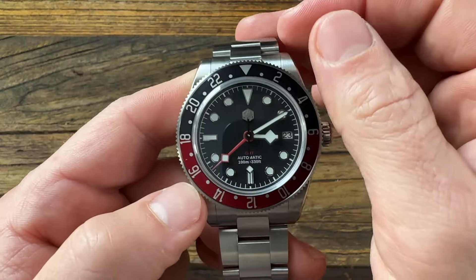Another test of quality is alignment. Is the dial perfectly aligned? If there's a timing bezel, is it in perfect alignment with the dial? On a dive watch, does the triangle at the 60-minute mark line up with the 12 o'clock hour marker? When manufacturers assemble watches too quickly, technicians aren't spending that extra time to properly align the dial or chapter rings. The lower-end Seikos are notorious for this. Unfortunately, with the San Martin I just got, the bezel is misaligned — when you're using it to track the 24-hour GMT hand, it almost reaches the hour marker a little bit ahead of when it should.